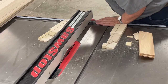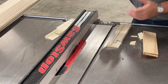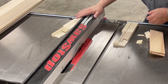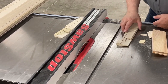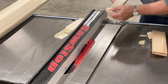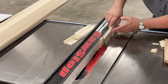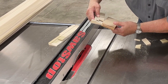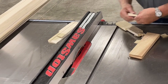Okay, we are just a shade less, and I mean not even a real measurement, just a bump less than 3/16 on our saw fence. We're at 14 degrees on our blade tilt, and we set our saw blade height at 1 5/8 because that's where our kerf line was. So that is right where we want to be. And when we put our panel in, it fit. Let's see if we can break that out. There, that's just exactly what I wanted.